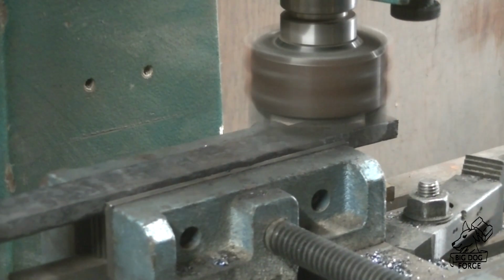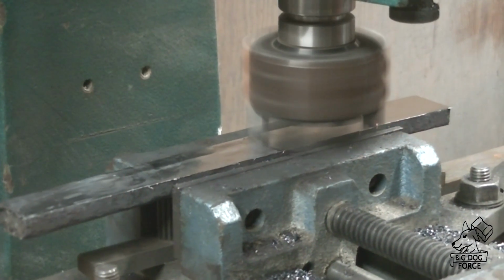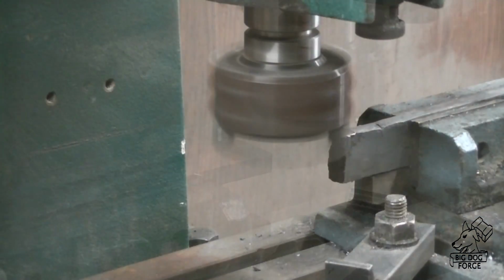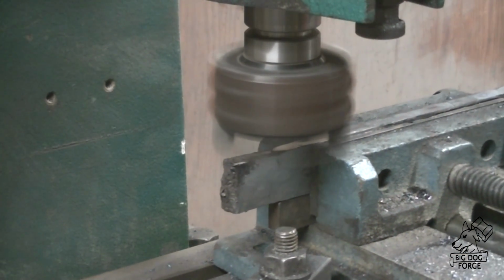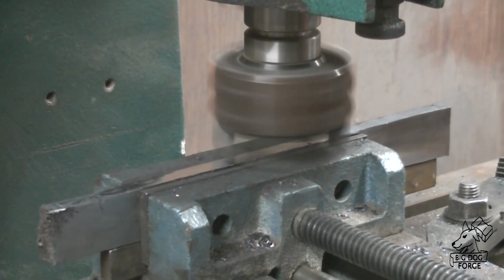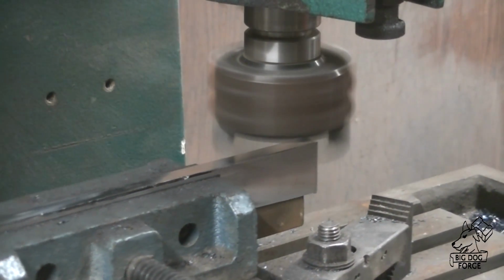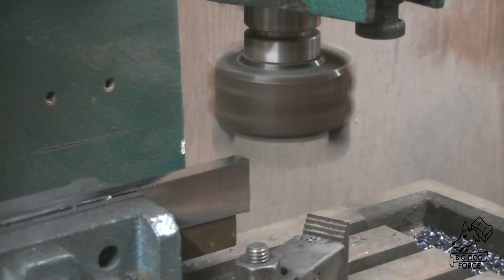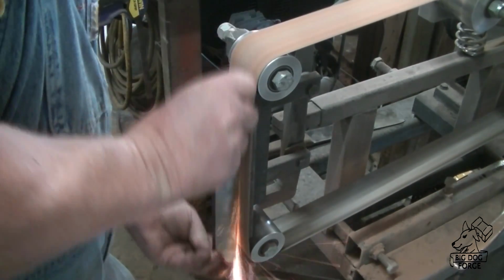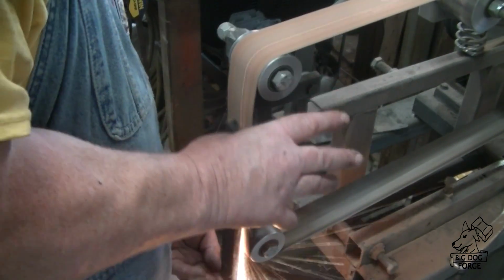So like I said, we're going to go ahead and mill off all 4 sides of this thing so that we can get a real good idea of how many cracks, fissures, pits, any separations, delaminations, inclusions, and the list goes on. And we got our fingers crossed the whole time. And we'll get this thing over to the grinder.